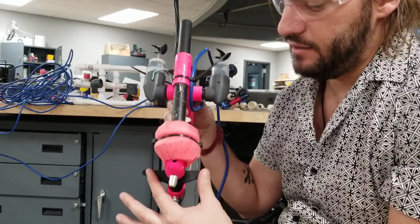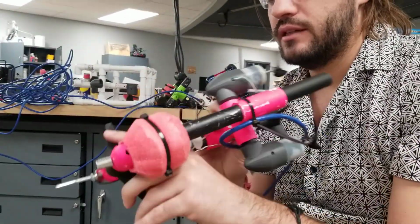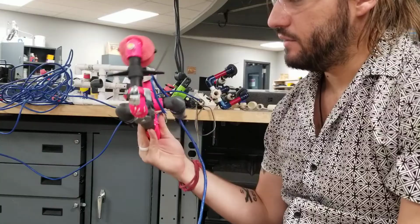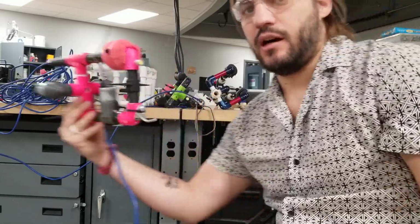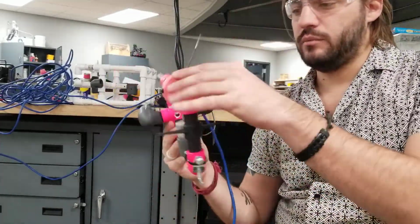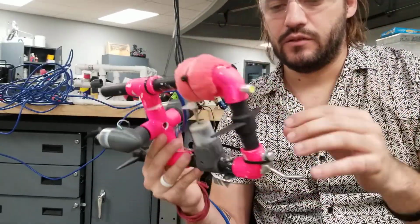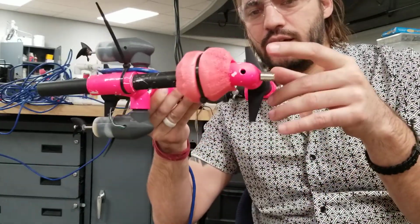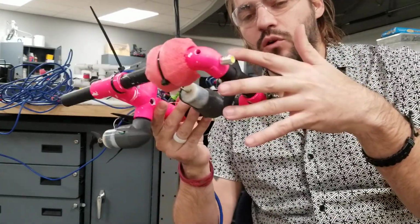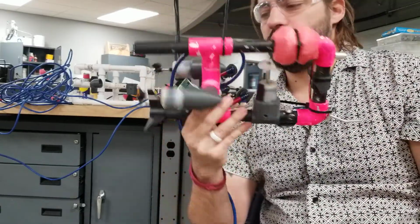Another thing that they have are fins. You can see the fins here at the front. They're stabilizers, what you'd call them if they were on a plane. So when it's flowing through the water, if it's going up and down like this, sometimes you'll see an unbalanced Seaperch. The common thing is it'll be like this, because the motors are generally pushing in the wrong spot, and then the buoyancy is fixing it, and it's just not very efficient. If you have these fins, it makes it more work for the Seaperch to go up or down because it has to push through more water. So it wants to go through here where it's really skinny. It helps stabilize it and reduces that vibration.